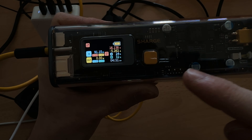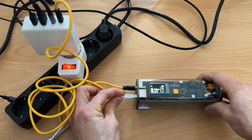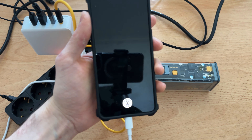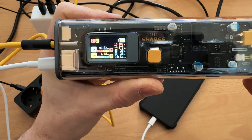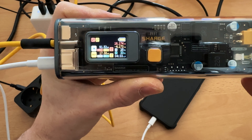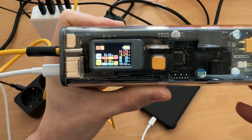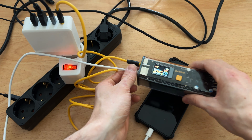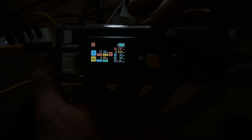While waiting to reach 100%, let's test parallel charging — using the C2 output to charge a phone while the power bank itself is being charged. Yes, fast charging works! We are still charging the power bank at 90+ watts and simultaneously charging the phone at a solid 17 watts. The display shows both the red and yellow USB icons and the battery temperature is slowly rising. The timer is also running. After disconnecting, the power bank reaches 100% — temperatures look fine.